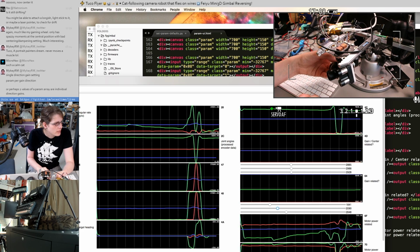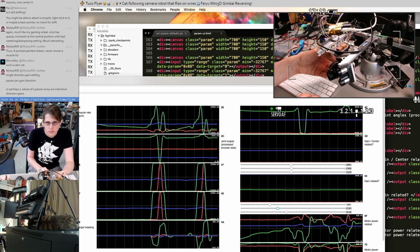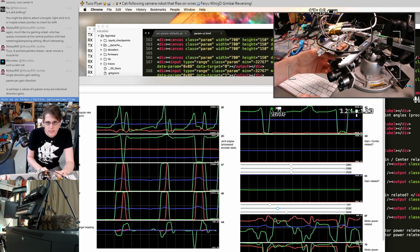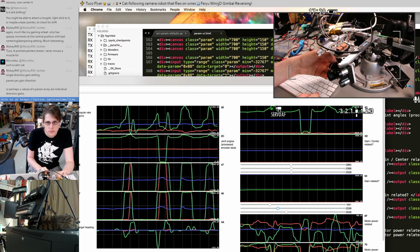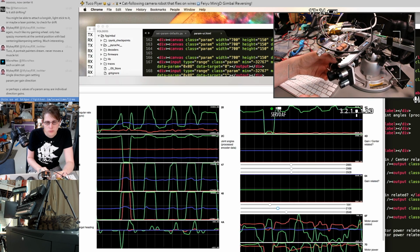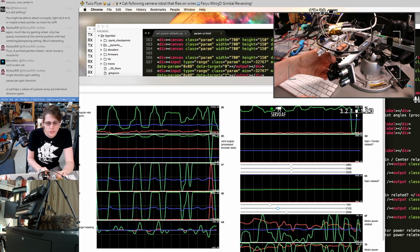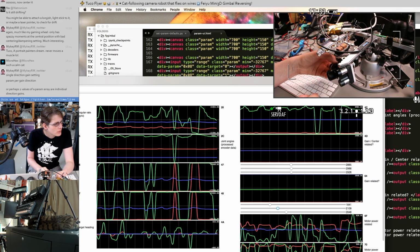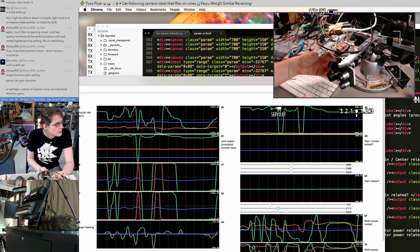Oh, interesting, yeah. This is now locking into the wrong positions. I'm at like 2090, and it's like it's off by an entire motor phase or something. And now around 2100, it's not a sharp cutoff though, it just goes from holding kind of the wrong position. It's still drawing a good bit of current. It's like 800 milliamps total right now.